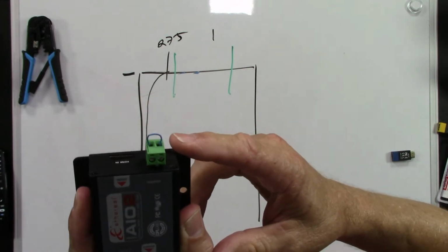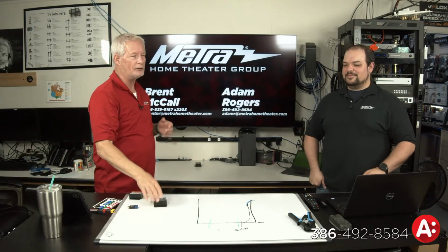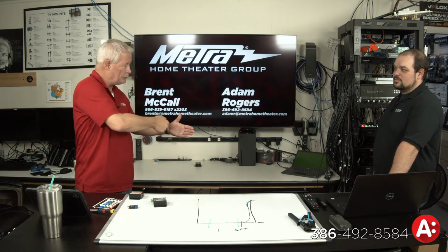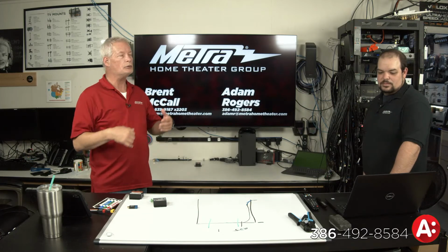This Phoenix plug ties to something with a relay on it. Yes. So when you turn the system off at night, you open the relay. That, for all practical purposes, unplugs that cable from the system. Yep. When you turn the TV on in the morning, you close that relay.